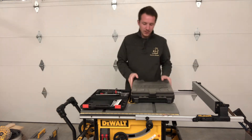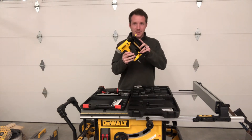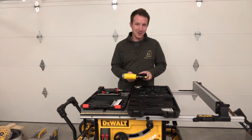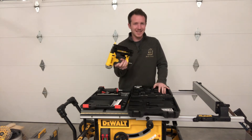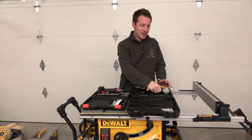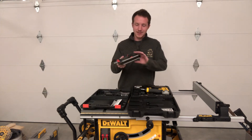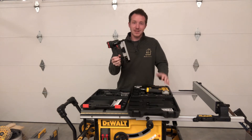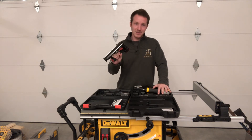The DeWalt pin nailer won't do half-inch nails, so this will take 5/8 inch pins all the way up to 2 inch pins. I needed some half-inch pins — the material I was nailing was 5/8 of an inch thick. This gun I picked up for about $200, and I was looking around for other pin nailers that could do half-inch and came across this little Banks pin nailer. I'm actually a big fan of Banks's framing nailer — there's a link in the description below where you can watch my review on that — and I decided to give this one a shot.